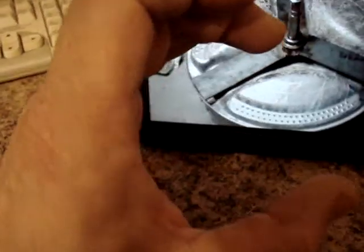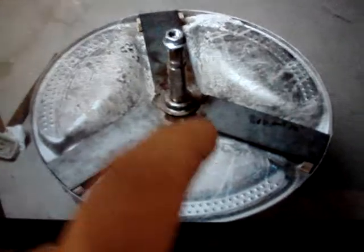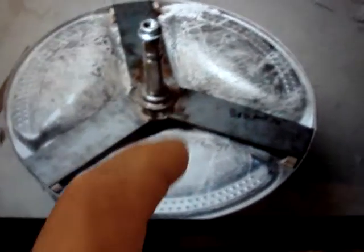They are actually welded to a four inch circle. The four inch circle holds these, and then with a bimetal hole saw, has a one and three-eighths inch hole drilled down through it, which is exactly the size of that shaft.